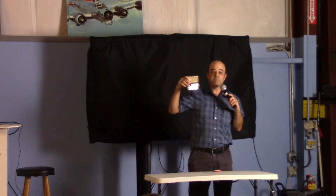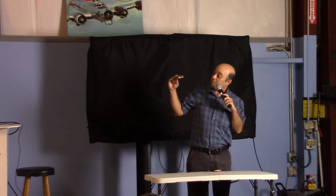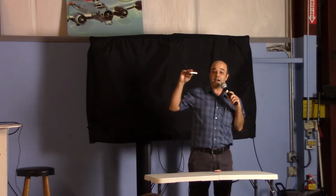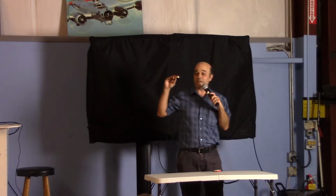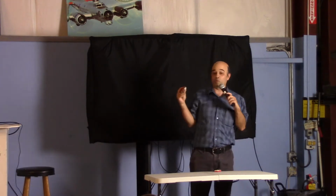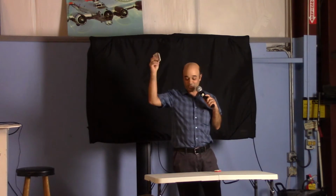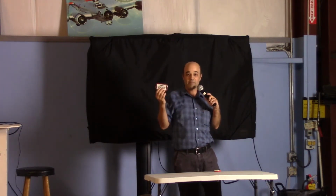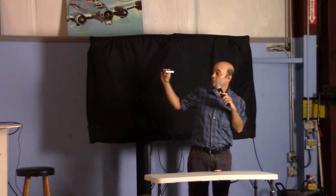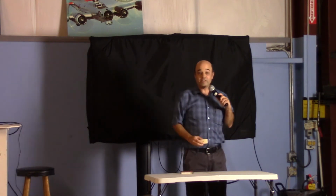I insulated it. It's a real simple adapter. Just have some banana jacks on one end and a BNC to hook to the scope on the other end, and now I can stick my scope right into a live, hot, scary tube rig, and all I have to worry about is killing myself, not the scope. So that's a fun little project. It took me a little bit of time to build. I had pretty much all the parts around, and then I labeled it 1 kV, 10 to 1 scope adapter. Set the scope at 10 to 1 and it's ready to use.